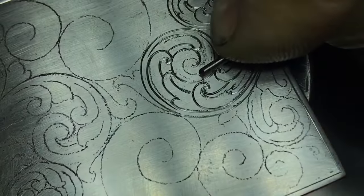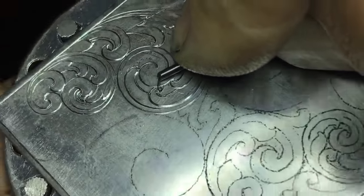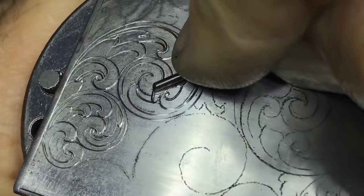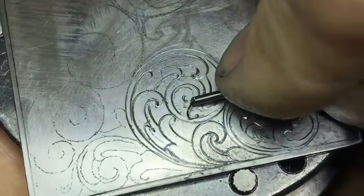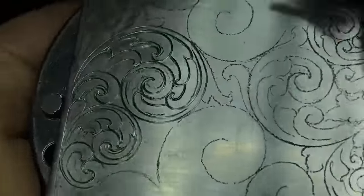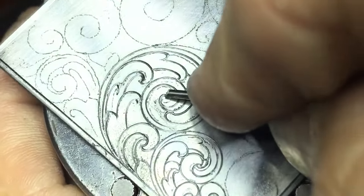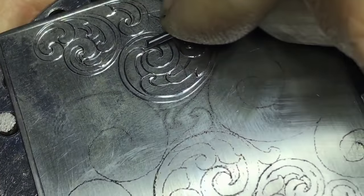One of the ways to ensure a smooth flowing backbone is to coordinate the left hand that rotates the vise with your right hand that's controlling the cutting. Always be sure and stop your cutting when you reposition your left hand, and then start again once you're repositioned. Don't ever try to rotate too far in any one stretch.